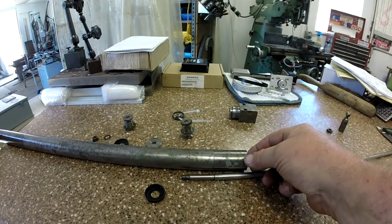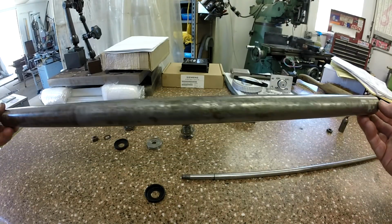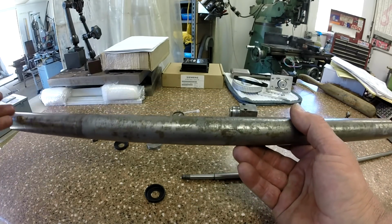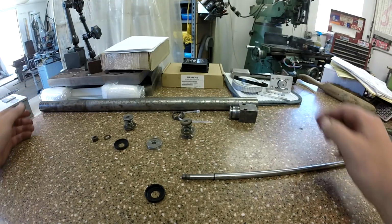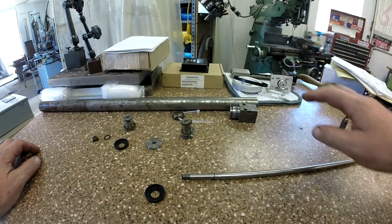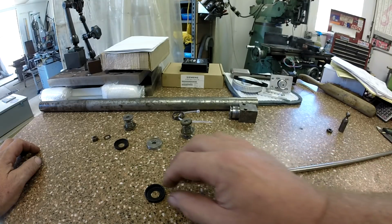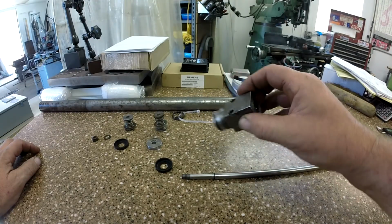And I've got a little ball hone that'll do. I can get about halfway down this tube with it. Then I'll be able to come in from the other way and do the other side. So no big deal to get in there and just give that cylinder a quick hone, get some fresh seals on the piston, and more importantly, replace that rod seal.